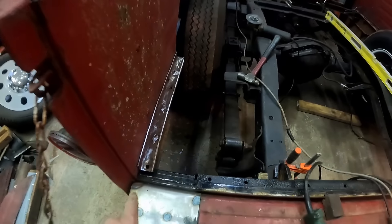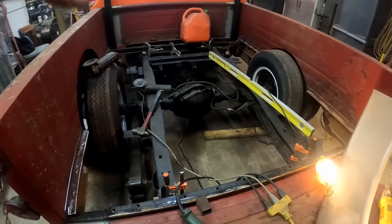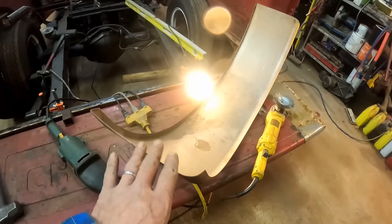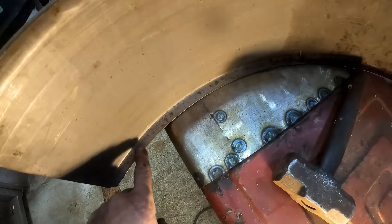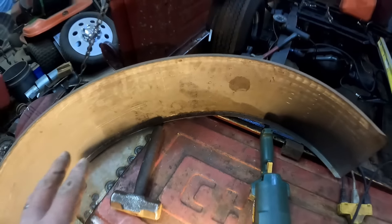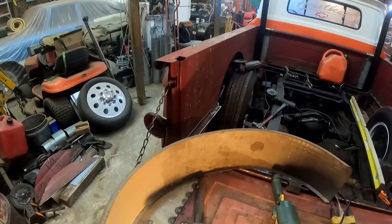The plan is we're going to go in here and build a new frame out of some square tubing for all of our wood to sit on when it does come time to put the wood in. And it'll give something for these to fasten to as well. I think these are going to give it a nice finished look because of this folded-over edge right here. We'll drill some holes for plug welds and weld it from the inside to the bedside — no exposed welds. It'll look really nice and seamless.